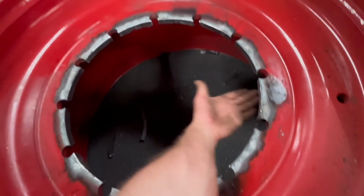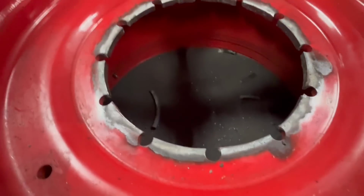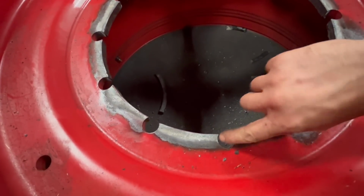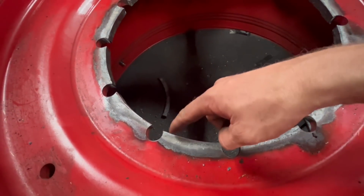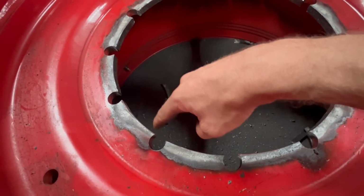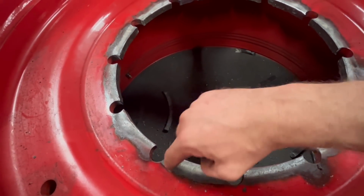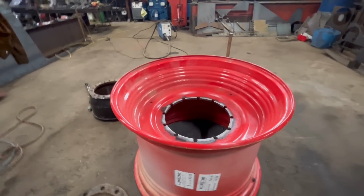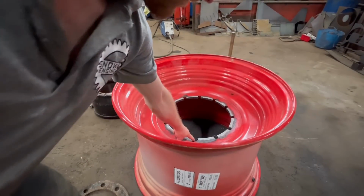And then I can weld my other plate on that side now with the bolt holes in. What I'm going to do, I think, is chop off these corners across there, so then when I weld it round, I can weld it round into the hole, back out and carry on and do away with that sharp corner. Right, I've got you sat on there. Remember to press record this time. So I'm just going to nick them corners off now.